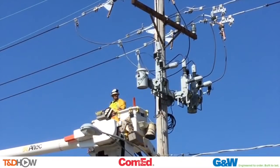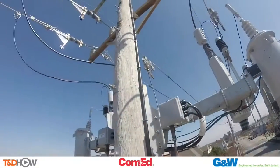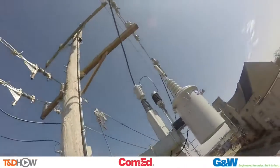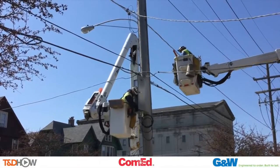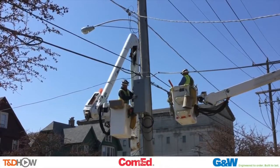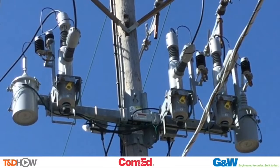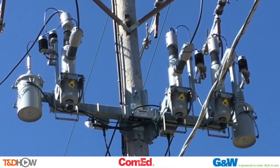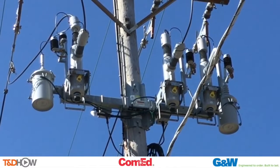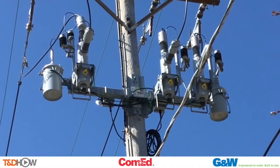And with that, our line crew is almost done. As they descend, the lineman looks up to inspect, and you see through the magic of GoPro what he sees to make sure all the taps are connected. Last but not least, they come down to the control box and install a backup battery. As we close with video of the installed recloser, we can see from the ground that the position indicators remain in the green or open position. That is because this recloser is serving as a tie point, thus remaining in the open, disconnected position.